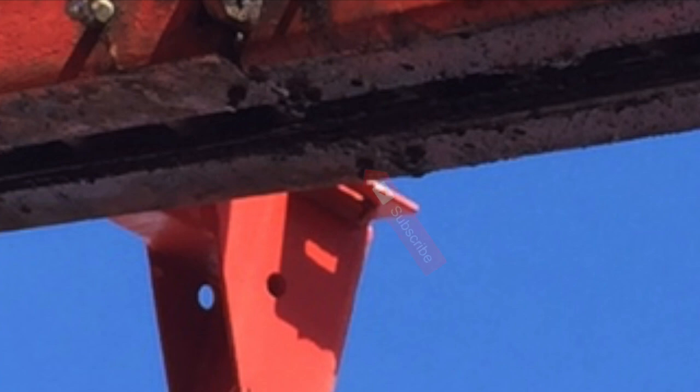But a lot of manufacturers simply dovetail the edge like that, and they anchor the bottom at the base, and then they put the next piece up, and they go right on top of there. Most rides keep chain liner sections between, most are metric, so I say between 1 and 3 meters long. Those are your standard lengths of chain liner in most rides. So when you look at chain troughs and you see a lot of little hardware sticking out all over the place, that is the liner being held down on the inside.